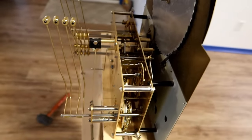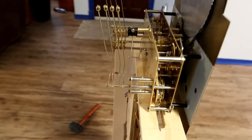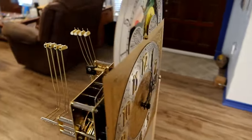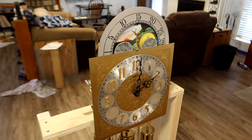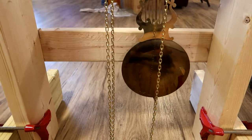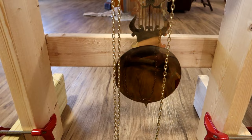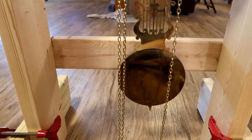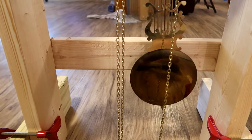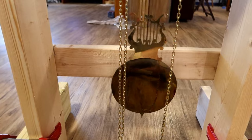I'm going to let this thing run a little bit. I may need to adjust the hammers, but that doesn't look terribly difficult. I've got to admit, as I'm watching it, the pendulum seems to have better motion too. I was concerned when it came here that the pendulum wasn't moving that decisively, but it actually seems to be moving better. Maybe that was a leveling issue. Maybe what I'm going to have to do is get that enclosure leveled before I put the clock mechanism back into it, because that may be all it is.